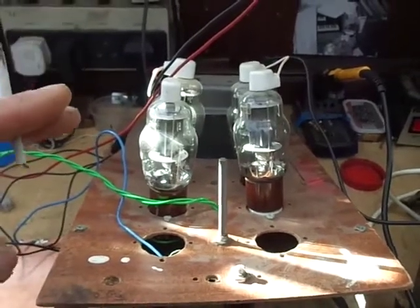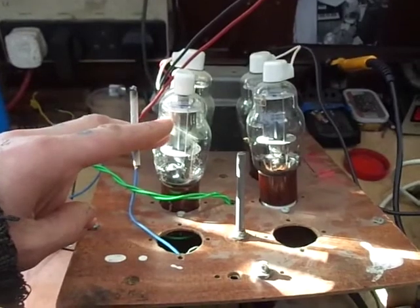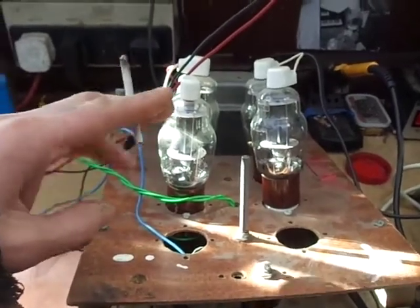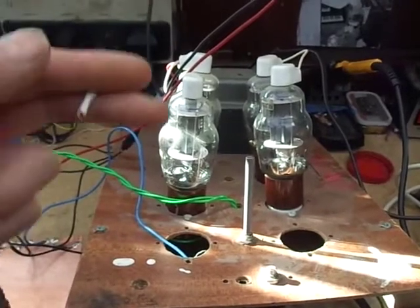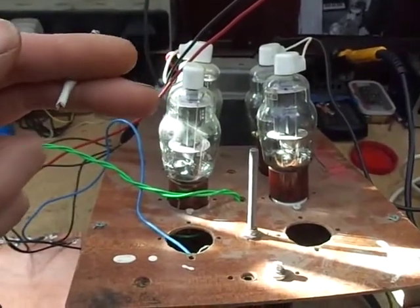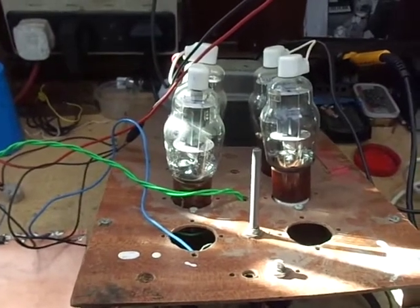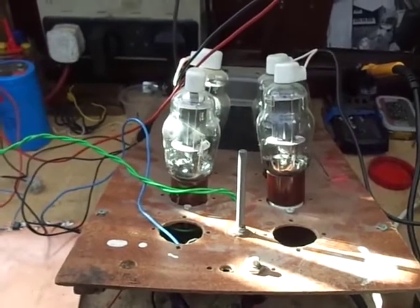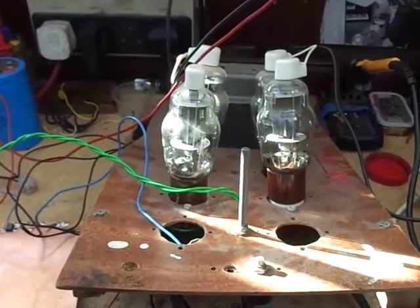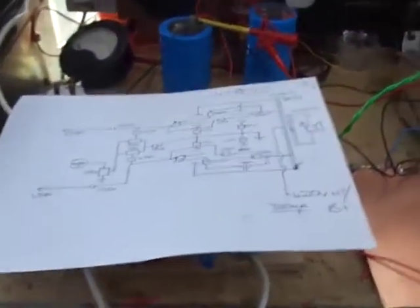The make doesn't matter much really, to a point. There is one proviso: valves made in the past are apparently better able to handle a higher HT or B+. Some of the newer Soviet or Chinese-made valves apparently can't handle as high an HT or B+, so that's worth bearing in mind when designing a valve amplifier.